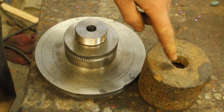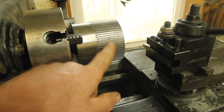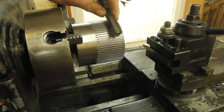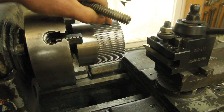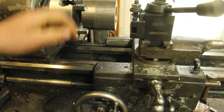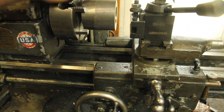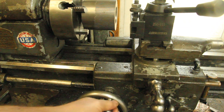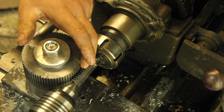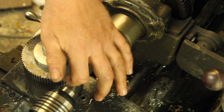I'm going to try to make the gear and then put it on. This time around I used the same tool that I used for cutting the hob to gash the blank for the gear. That should give the hob a lot more to bite into so it won't slip as much. These are cut to 45 thousandths deep. Each pass going back and forth was 5 thousandths, so it took 9 passes on each one — 72 of these, 648 passes — got a couple blisters on the hand, but this handle looks phenomenal now. I'm a lot happier with this setup, but just to be on the safe side I'm turning this by hand for the first couple passes to make sure that everything is lining up properly.